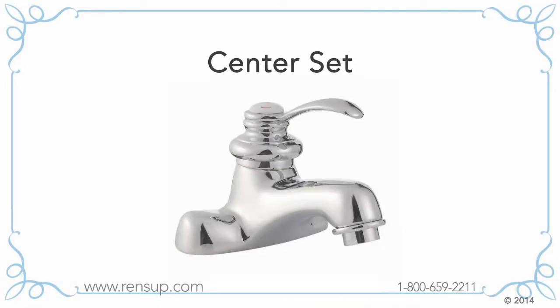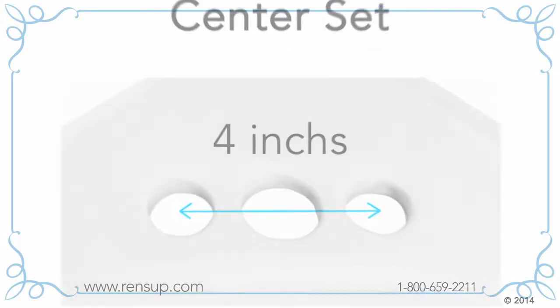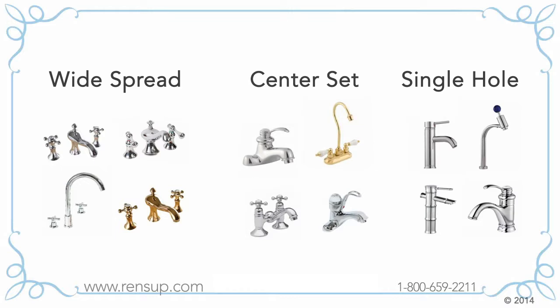Center set faucets are one solid piece. On sinks drilled for center set faucets, there are 4 inches from the center of the hot pipe hole to the center of the cold pipe hole. Sinks drilled for single faucets have one large single hole. We'd love you to buy your faucet from us, but you don't have to.